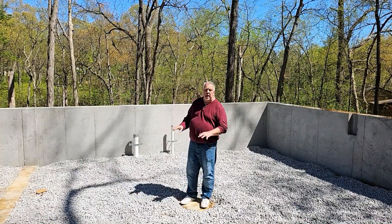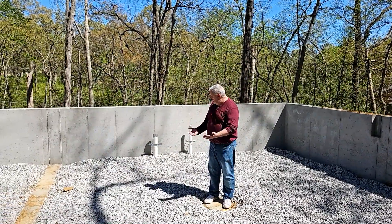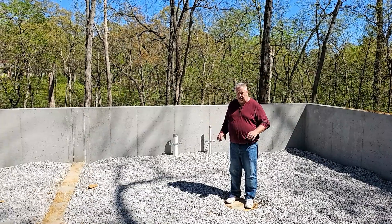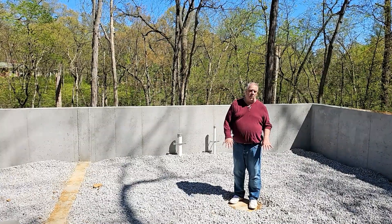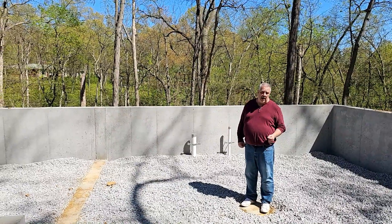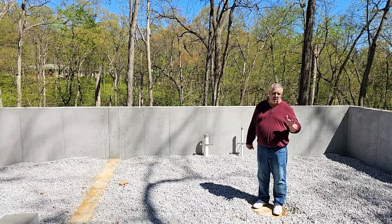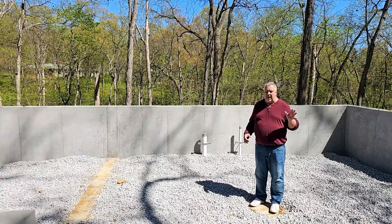The detail in here calls for four inches of foam, then we're going to do a Stego 15-mil wrap vapor retarder. It's going to run up the walls, get taped off, and get a termination bar to seal any soil gases and keep all the bad stuff in the ground. That keeps the crawl space nice and clean, and it'll sit on top of the four inches of Subterra foam — right around R-26. This is a passive house inspired home.